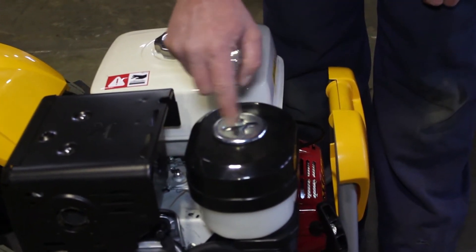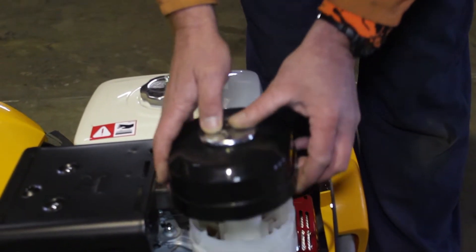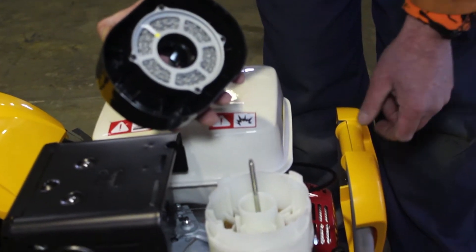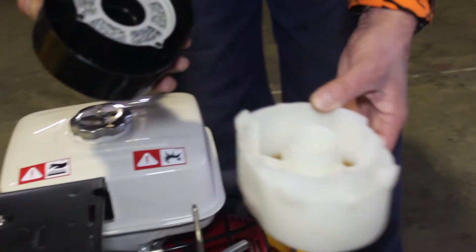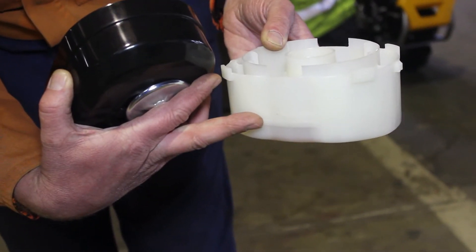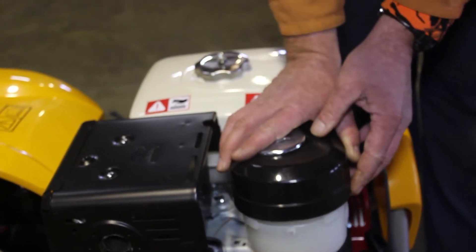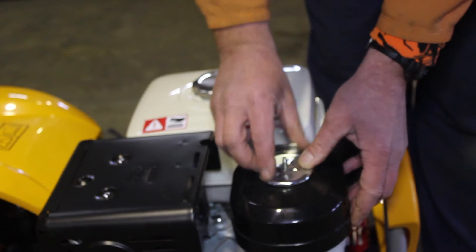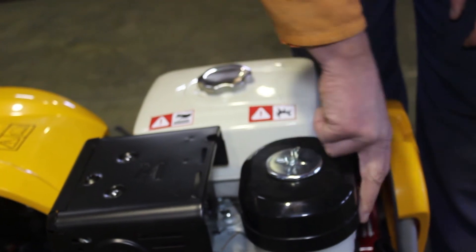This is your oil bath air cleaner. You do need to check this every couple of hours. To do that you just remove the wing nut, remove your top cover — this is part of your air cleaner up here, this is your oil bath here. If you find a lot of dirt sitting down in here you need to remove that, tip the oil out, clean this and replenish it with oil — just fill your oil up to the top mark, the level mark there. Once you've done that, to put it back on you just sit that on, sit this on, sit your plate on and just tighten up your wing nut. The oil that we put in there is a SAE 10W30 oil.